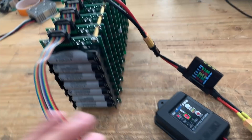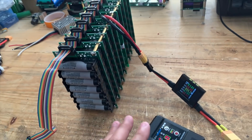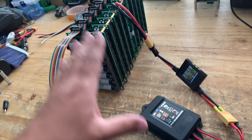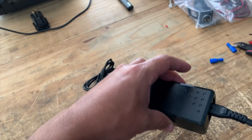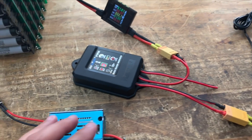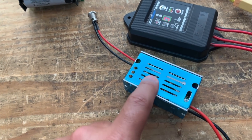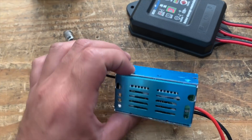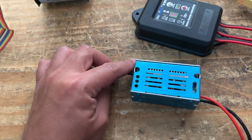I'm trying to figure out how to make something that you can charge via solar and also off the wall, using one of these chargers or one of the smaller ones. I was thinking of using just a regular DC-to-DC, but the problem is that's not a proper charger — it doesn't have the constant current / constant voltage two-stage charging.